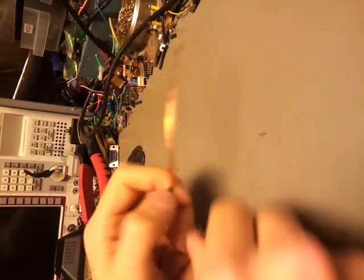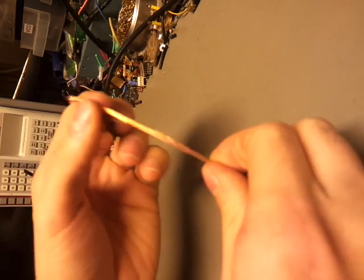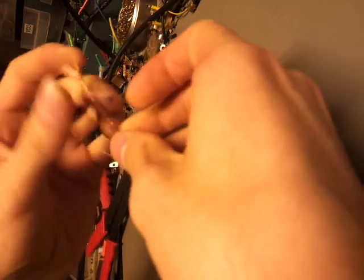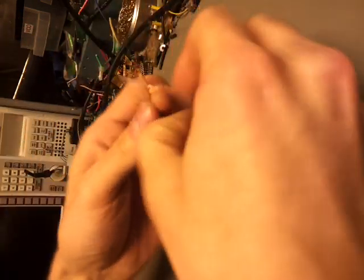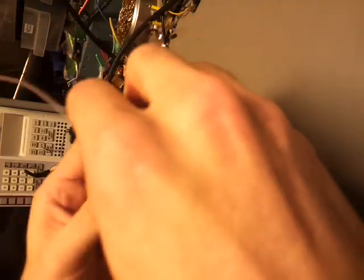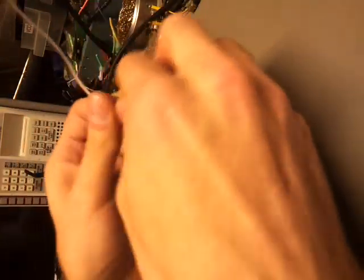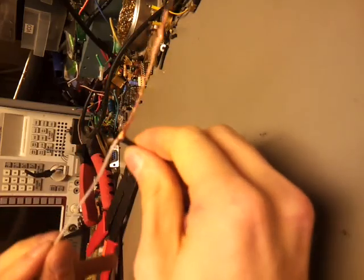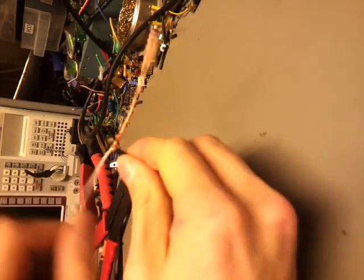Okay cool. Now we have the wire exposed. Now we just separate these two. From here, the copper stuff is the coax shield. As you may notice it's not that thick or anything. So we just separate the center conductor and the shield. We roll the shield up. And voila — we have a simple half-wave dipole.